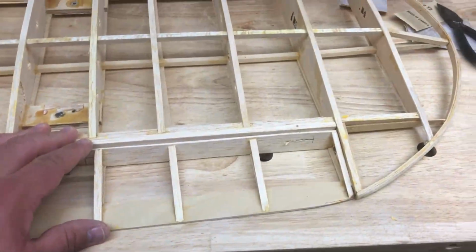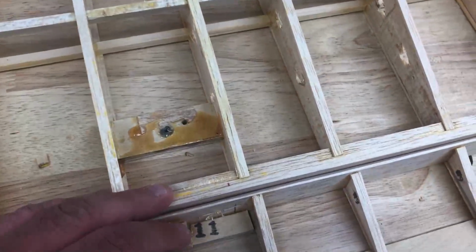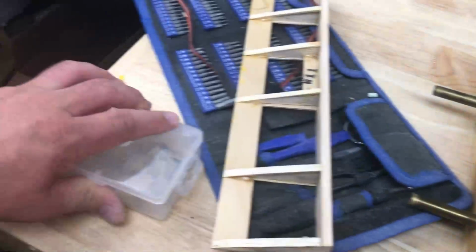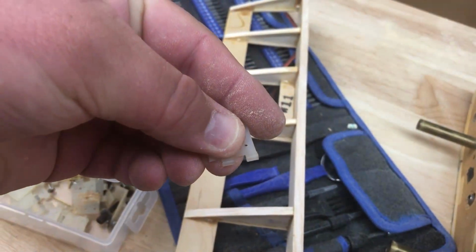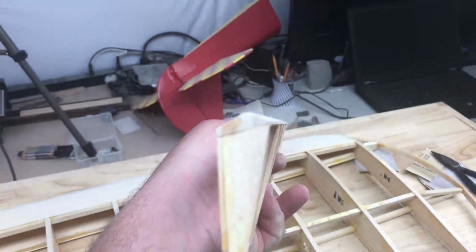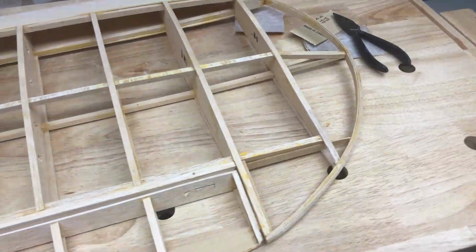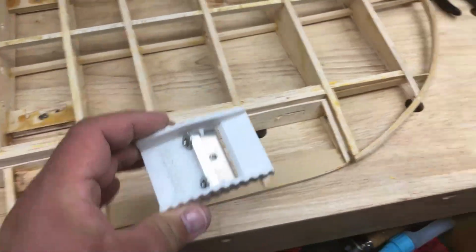When you hold the wing, originally there was not any meat taken away for the hinges to pivot. So it would stick out the length of the pin on the hinges, just that little bit, and that's all the amount of pivot that you got. There was no beveling of the leading edge of the ailerons, so I went ahead and did that. I used my plane, which is 3D printed, but you can also get those from, I think, Dubro. Mine's 3D printed, made out of ABS. It uses a little razor. It's perfect.